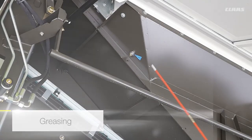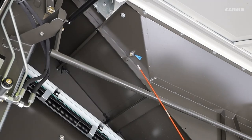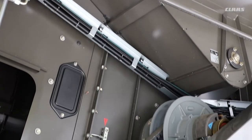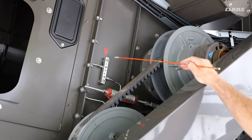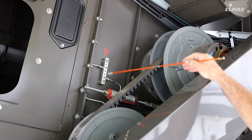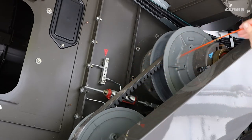While we're still at the top, we have the grease nipple up here which greases the bubble-up auger. As we come down, we have these grease nipples here which are on a 50-hour greasing schedule. Don't forget the tensioner here as well.